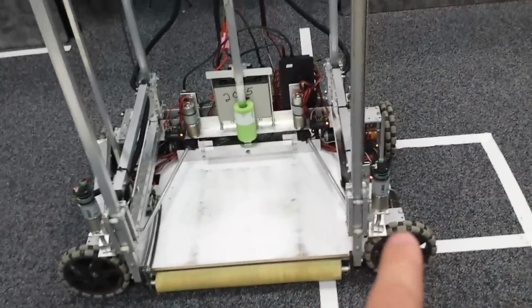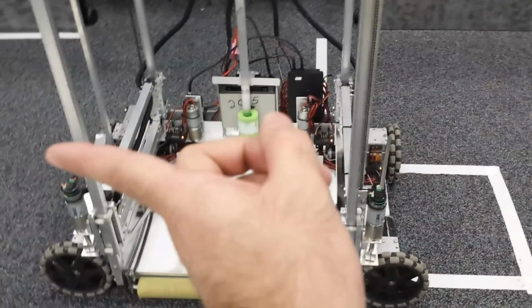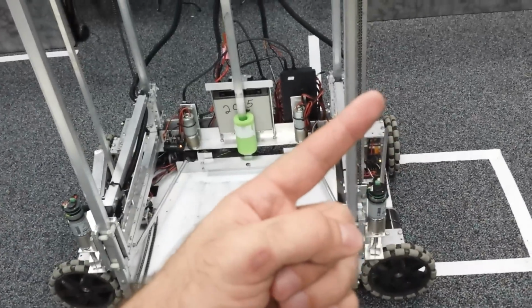So with that being said, doing all these maneuvers allows us to go sideways, as I just explained, forward and backward, and then with a combination of the two, with basic trigonometry, you could actually make it go in any direction. So if these two motors are full force that way, these two are full force that way, it'll have a tendency to go 45 degrees.